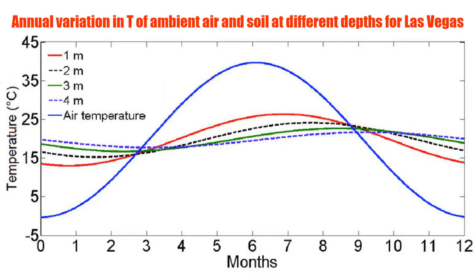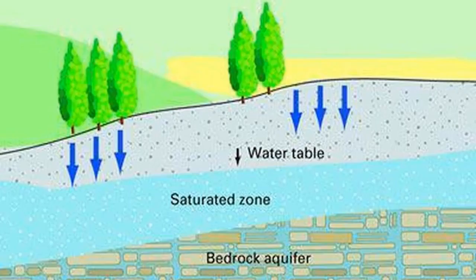So when we look at the Earth, we see that there's a water table, which is the top line of the saturated water zone, right? And quickly we understand that it's because of the water mass underneath the water table, right? Basically, the water acts as the thermal mass, and because there's massive water, the temperature there is relatively steady, and that's what we call the low temperature geothermal, right?